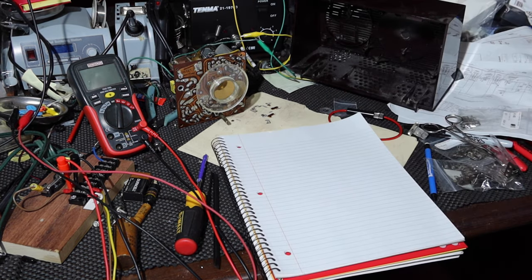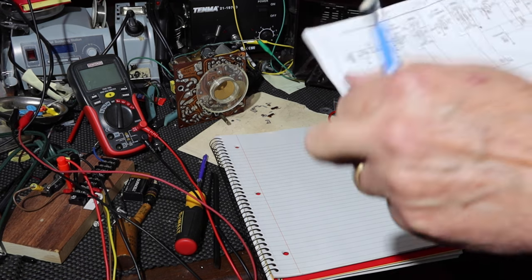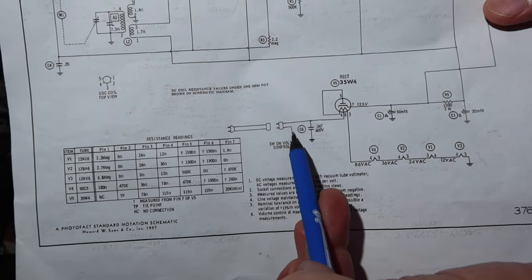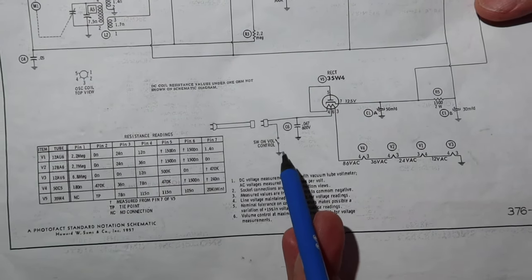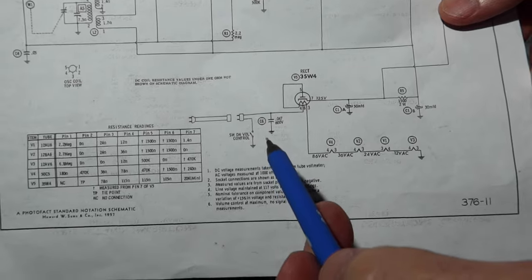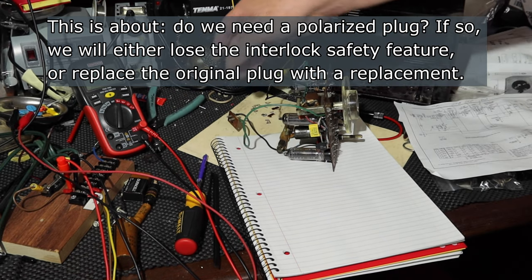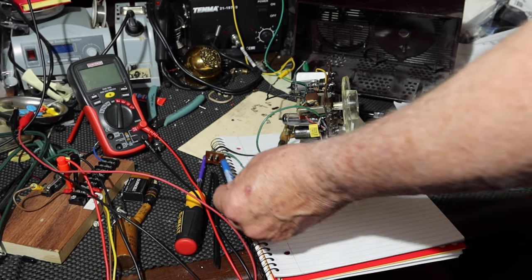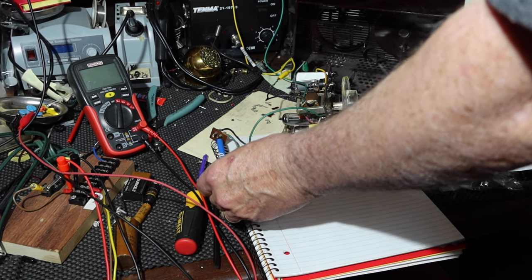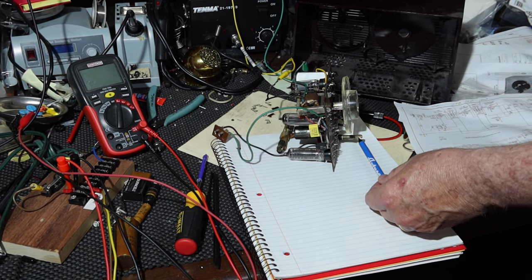Okay, so I think you can see this okay. So you remember we talked about doing the switch here. One of the things I was concerned about was, if this goes straight to hot, is there anything that can be touched that would have any communication to any of this? So what I did was I had this thing running, and I hooked up, now this has been on an isolation transformer, right? But I hooked up a voltmeter while this was running to each of these two posts individually and tested for any kind of voltage to this right here